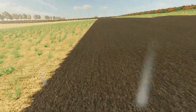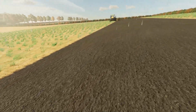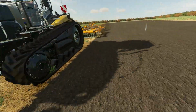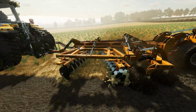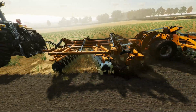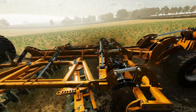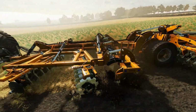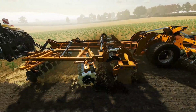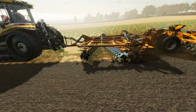So I'm just wondering whether we would be better taking the subsoiler legs out, or out of the work, because they're on rams, on what's called a two-way ram. So essentially, as you can see, they're on rams there. What happens is if the leg hits something underneath that's really hard, say a tree root or a rock, or whatever's buried under there, that ram gets activated as soon as it touches something that it can't move. The ram flips back and it chucks the leg up out of work, and it stops the leg from shearing and breaking and snapping.